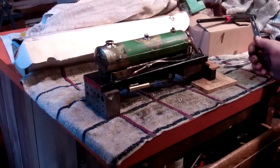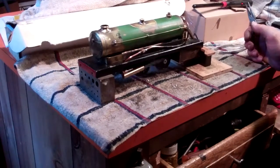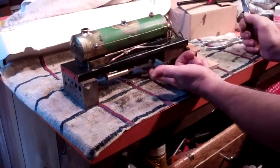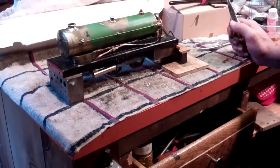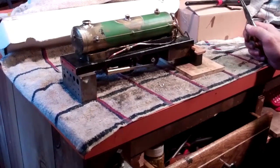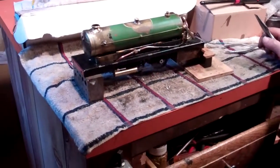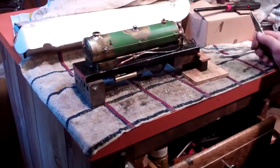A lot of guys run these on all six burners. I've seen on some YouTube videos that guys control the speed by turning off burners, but I think this throttle valve works good — it's still got fairly good power even when throttled down. As this heats up more it'll run even faster at this setting. There's a little bit of pressure escaping this valve, which tells me there's excess pressure in the boiler — so I'm not going to run out of steam pressure.